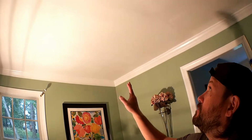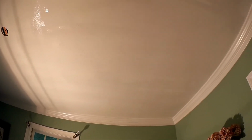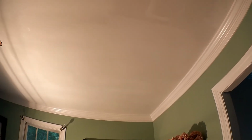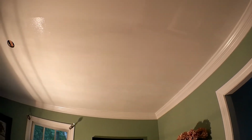Put a second coat of primer of that Zinsser's Bullseye primer, which was a water-based primer, on the ceiling, and I just painted it with the ceiling paint. It's right in here, was that section that had water stains. It's still wet right now, but I'm just waiting to see if it will actually bleed through on this ceiling paint. If not, I think I'm good, but it doesn't look like it's coming through right now, but time will tell, actually, as it starts to dry.